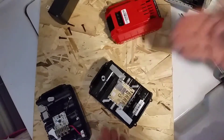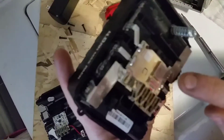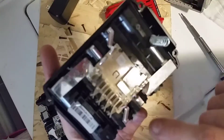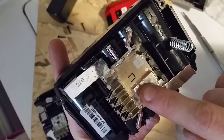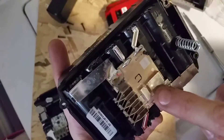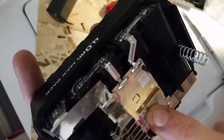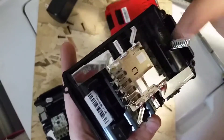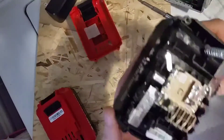The purpose of this video is because I couldn't find one of these batteries taken apart on the internet to see what it's supposed to look like. You can kind of see right there — there's a burnt spot there and a burnt spot there. Something would have connected the two points — a little tiny thin piece of metal, just at the very tip right here. That apparently acted as a fusible link and it's been blown. So I'm going to join these two contacts together and it should fix the problem.